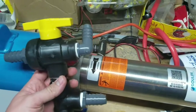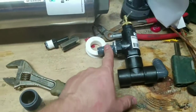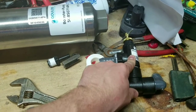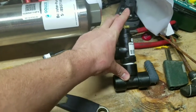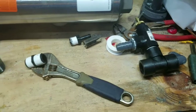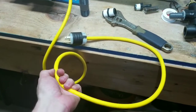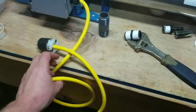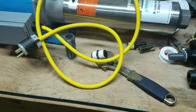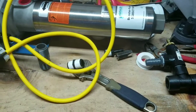These two will be the inlets, this will be the return. On here we'll have the outlet going to the hose reel, and this will be the return from the regulator. Don't touch the regulator when you first get it or you'll mess up the pressure — and unless you've got a bleach-resistant inline pressure gauge, you won't be able to properly set it. Also, as mentioned in several other posts, buy 10-gauge cord — big, fat, high quality. Might as well buy the right stuff to begin with. Thanks Tim — have a great night guys.